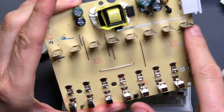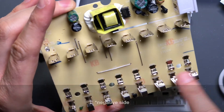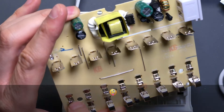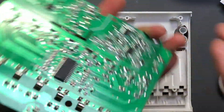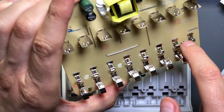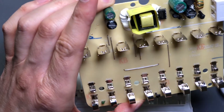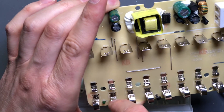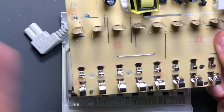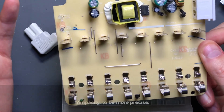These top parts here are the positive sides of the terminal for the battery charging, and the bottom side for the AAs. There is a separate channel for AAAs - unlike the Power Owl, which had the same looped-in metal piece that went between the AA and the AAA, which was just horrible because it would slam the AAA cells with the same amount of current they just don't have the power handling capacity for.